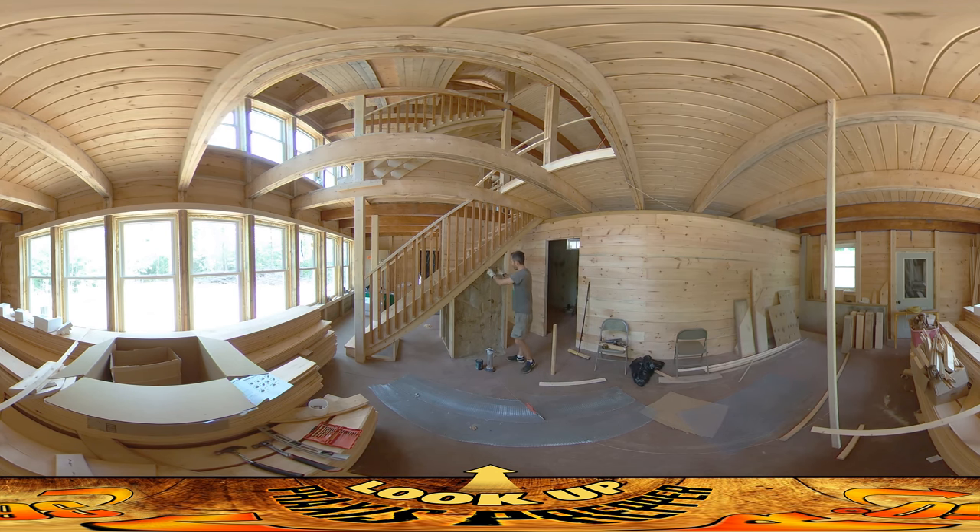So this is going to be the stone area. I've got vertical 2x4 studs on the back here — these are sort of like trim pieces. This is going to get a cap on the end and I've got some plastic down on it right now. The reason for the plastic is I'm going to be using concrete, stone, and wire lath, and if you just go with those it can get pretty messy. With a plastic backing I can put the stones up to it, fill the concrete in the back, and not worry about it dumping over into the closet on the other side.